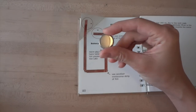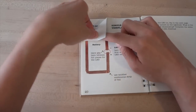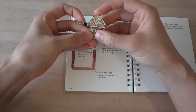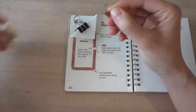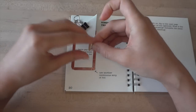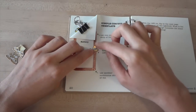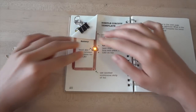Next, we'll add our battery, which is going to power our circuit. Place it plus side up to match the circles on the template. Fold your corner down over and clip your battery in place with the binder clip. Finally, we're ready to add our LED. Take your LED sticker and place it over the footprint in the gap between your copper tapes. Make sure to align your LED with the footprint on the template — the pointy side should be up and the wide side down. Press firmly on the metal pads to make sure you make a good connection, and your light will turn on.